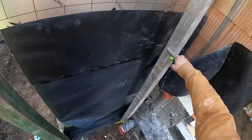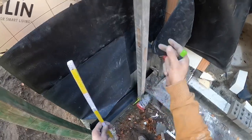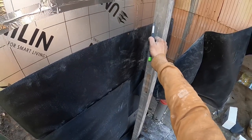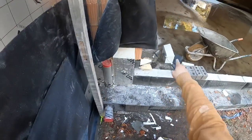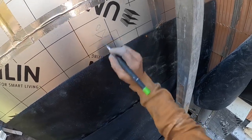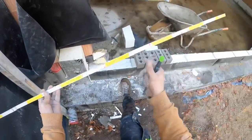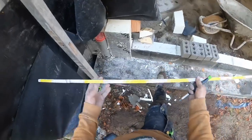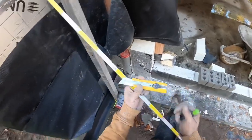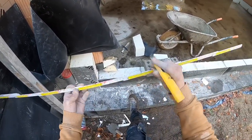This profile is not gauged yet, so I'm going to explain one more time how I do it, because it's important to work correctly. I already have a one meter datum — one meter above the finished floor inside, which is level zero. I have my gauge stick, it's just a foldable ruler, two meters long, and I carved my gauges into the ruler because it's an odd gauge. I put my square against the ruler and carve the gauges in.